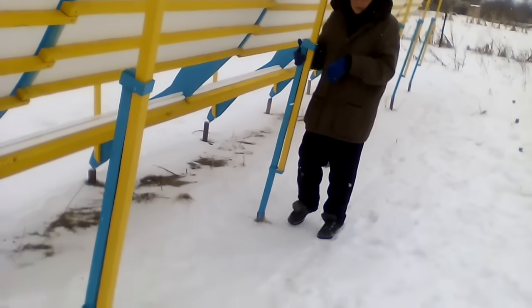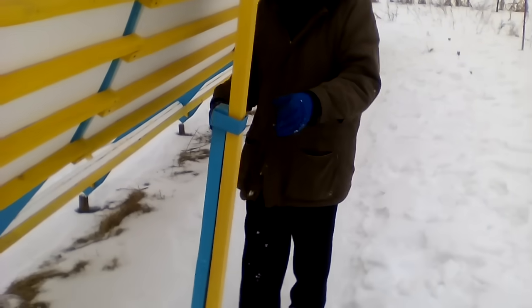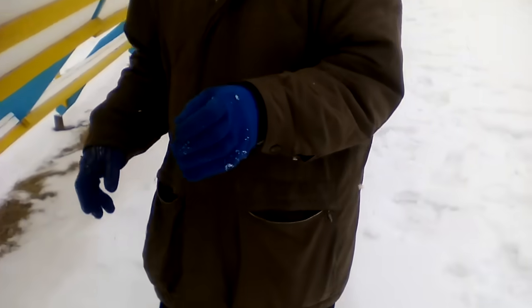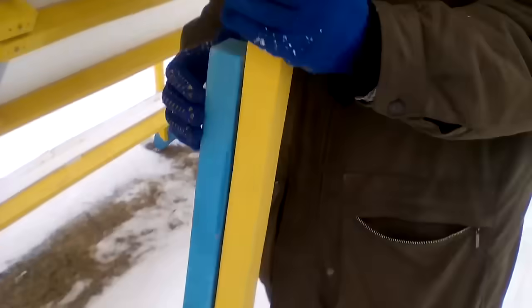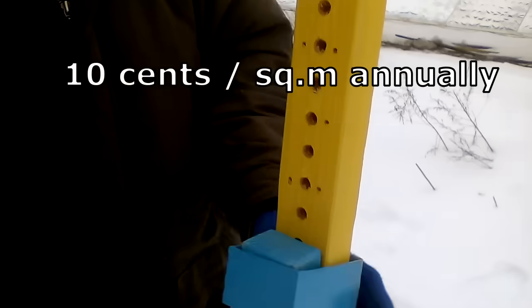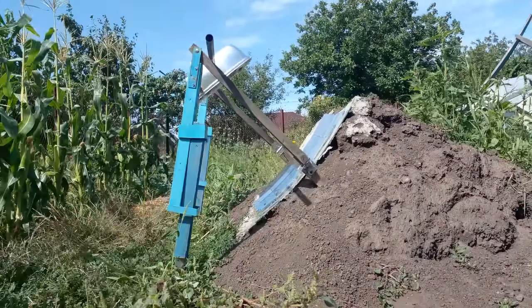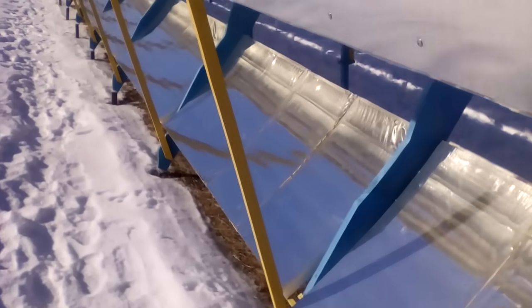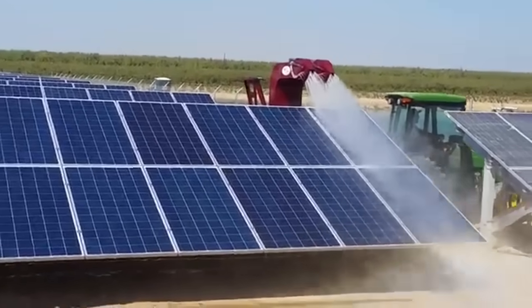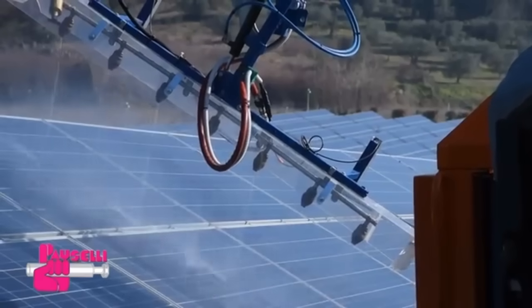Now I am showing how I changed the vertical angle of the mirrors on my solar station, and we will have to do a similar operation approximately 10 times a year. It is easy to calculate that 1 million square meters of mirrors will annually require 3,000 hours of a person, whose salary results in annual expenses of about 10 cents per square meter of mirror. An alternative to changing the angle of mirrors is to change the position of receivers in a similar way. I have not washed the mirrors of my solar station because they have a short lifespan — moreover, washing can damage the thin reflective layer. But perhaps gentle washing will increase the annual heat production of our mirrors, because rain and snow are not able to remove absolutely all dirt from their surfaces.